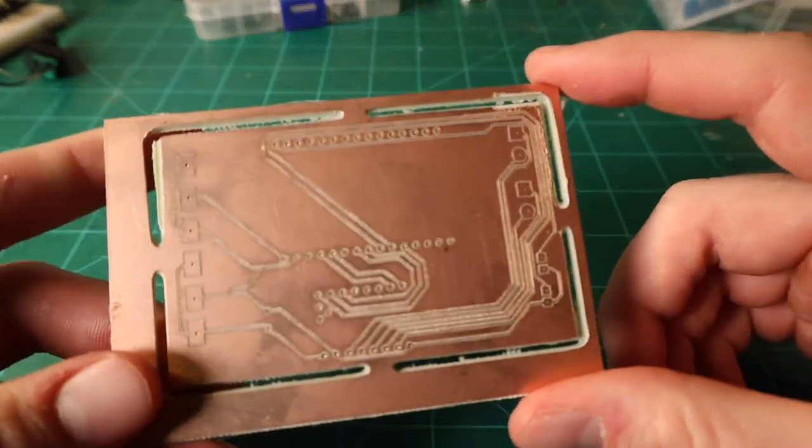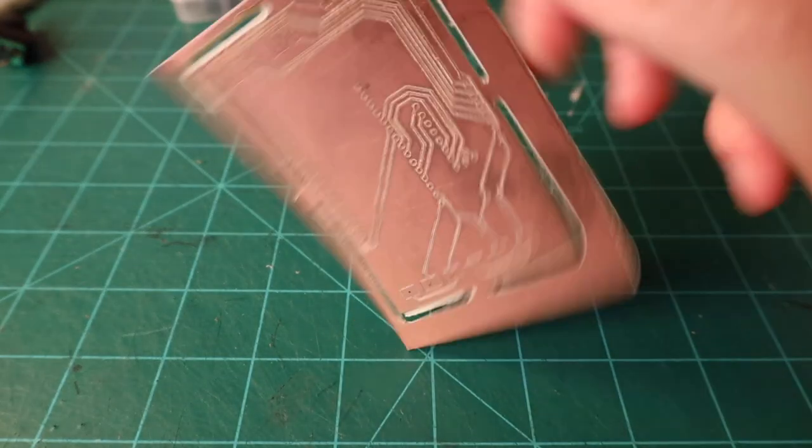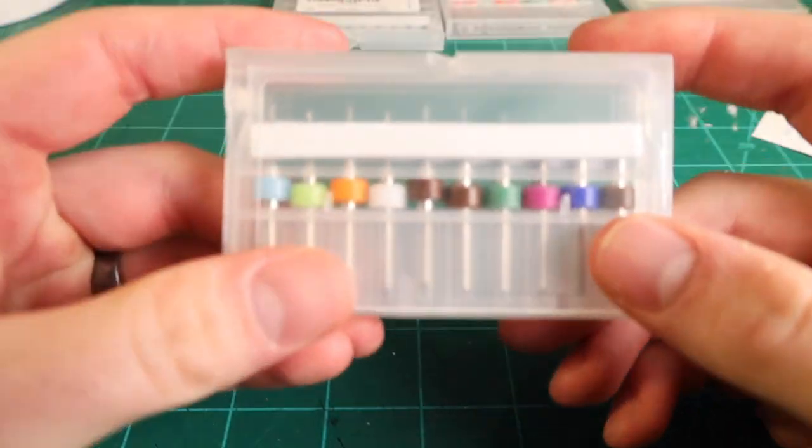On top of that, the designs that you'll get on a milled PCB often take up more space than a printed circuit board. So if space is a concern for you, you might not have much luck milling your own PCBs. If you're following along and trying to mill a PCB yourself, you may have to mess with the bit diameter or other parameters to get it to work specifically for you.